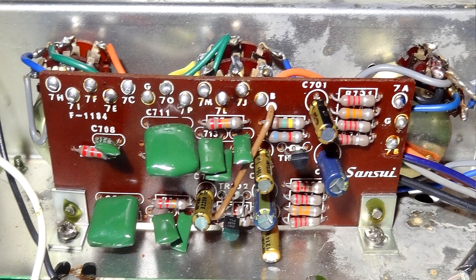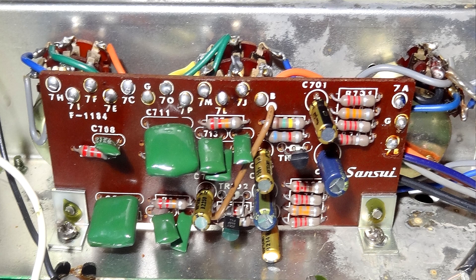For instance, a 4.7 microfarad capacitor can't be any less than 4.7 but could go up to 9.4. Just drawing your attention to this — it's from the official manual for this receiver. Anyway, let's get on to what I've done. I've replaced every audio capacitor — every capacitor in the audio department, which is the main amplifier board and also the preamp.